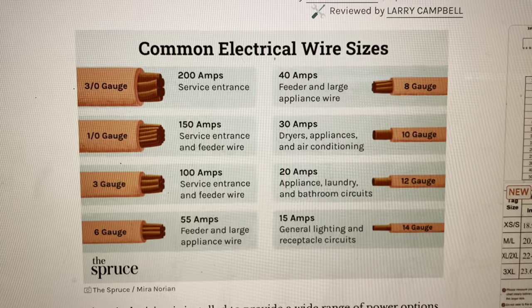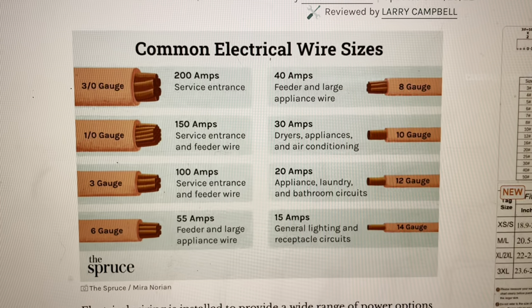For wire gauge: to connect the solar panel into our new system we went with 10 AWG gauge wire — that's just what Scout was using, so we matched it on our connector side as well. From the battery to the MPPT controller we're using 6 AWG wire. The DC to DC charging isn't set up yet, but we're going to be using 4 AWG gauge wire for that setup.